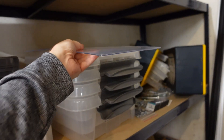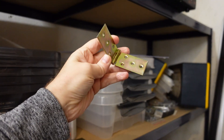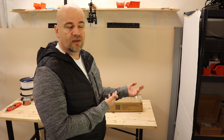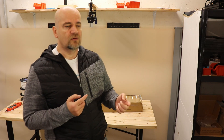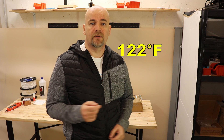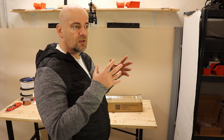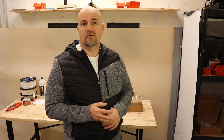Of course you can make an enclosure yourself. I have these shelves and I want to place the printers inside, but I don't have the acrylic glass and hinges yet — that's one of those twenty things waiting to be done when I have a free weekend. So the primary test will be printing ABS or ASA. I'll also measure the temperature inside and on the stepper motors, because they're quite hot even on an open printer. It is very important that during printing you don't open the enclosure, because you don't want to create any breeze or airflow — that way you can get very nice prints even with ABS, ASA, or nylon.